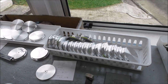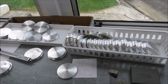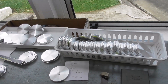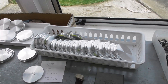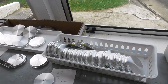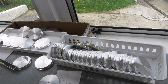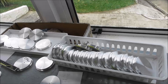I decided to run the parts on RapidTurn — there's nearly 40 parts on the first side — and see how it went, because that's not so critical. I found that the problems due to thermal expansion were less than I had anticipated. The diameter was maintained at about plus or minus one hundredth of a millimeter, or plus or minus half a thou. That's not high precision, but it's sort of medium, general workshop precision.